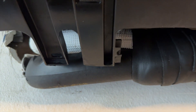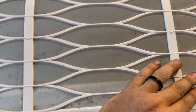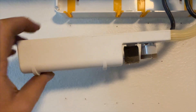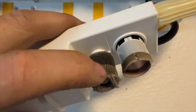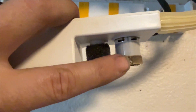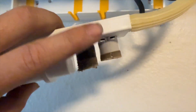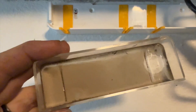There were no leaks on my flares and we got this all re-insulated, so we're going to go ahead and put this back on the wall. The filter isn't terrible but we'll clean it anyway — hose it off outside. The pump is definitely nasty. For these Gobi 2s they need to be serviced — the little strainer gets plugged and the sensor gets gunk on it, so it starts thinking there's water when there isn't, starts pumping air and making that loud gurgling noise. You can usually tell it's dirty when the reservoir is dirty like this.